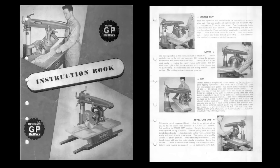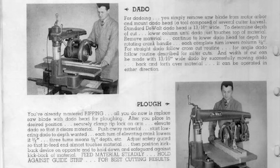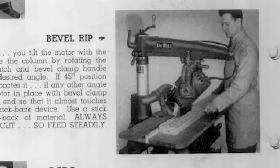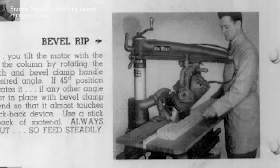This is from around the time when folks could come home from their stressful office jobs to their sheds and basements in the suburbs and unwind with a little woodworking in their shirt and tie while the little lady fixed them a martini. These images aren't great, but even in the beginning you can see all the things they claimed you could do with these saws. You see that one right there? Look at how much of the blade is exposed by the very nature of a blade being entirely above the table, as it is on all radial arm saws, and only half of it, at best, covered with a guard. If that board has a crack in it that you didn't see, or it kicks back and ejects across the shop — which can happen — where is Ward Cleaver's hand going to end up?